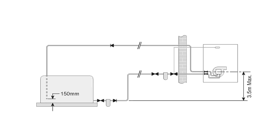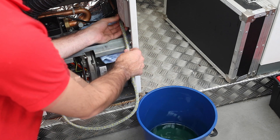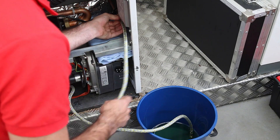Here you can see the double pipe sub-gravity feed system and single pipe suction lift with deaerator. When fitting the deaerator, it is important to prime the oil supply pipework to prevent damage to the oil pump. To do this, disconnect the flexible oil inlet hose from the isolation valve and place it in a container of kerosene. Then connect a spare flexible oil hose to discharge into the container.